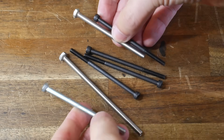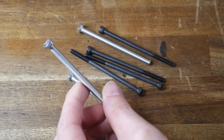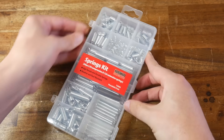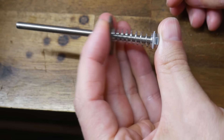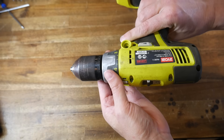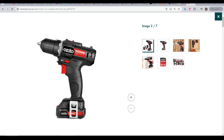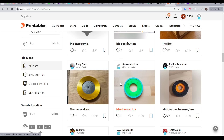My initial aim was to do this with no specialised hardware — just really long bolts, preferably with a hex head, but I would make sure the design could accommodate other bolt head types as well. I wanted the only other components to be some generic springs that would slide over the bolts and help return the foot to its original position. To make the design as universal as possible, I would target the clutch mechanism on the outside of the drill. Pretty much every drill has this and it doesn't turn when the drill turns. By making this part modular, my tool should adapt to different brands and drills easily.